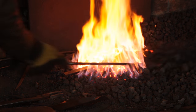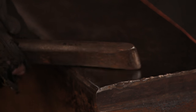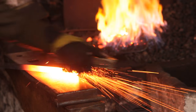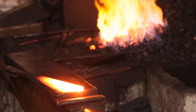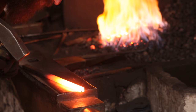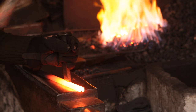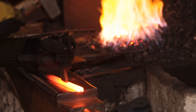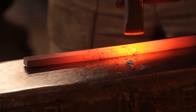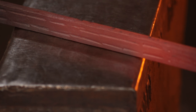This is a modified chisel which has basically been ground to a rounded edge, and you want to make sure you're giving your iron a good scrub every time — that'll save getting any dirty marks on it. To start the fullering I've not marked up a line or anything; I'm going to do this by eye, just putting the first row of marks next to each other. They're not overlapping by much, and that will just give me an idea of where the line needs to be. That gives you something as ugly as that — don't panic, it'll be a lot nicer in a minute.